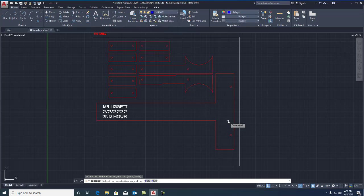The next type of line we have is an engrave. An engrave is similar to the raster. It's not going to cut all the way through, but with engrave we draw shapes. So for example, I could turn on my object snap or my grid snap, and I can draw a circle there. This circle will be in the handle, but it's not going to cut through the handle, it's just going to draw a circle.